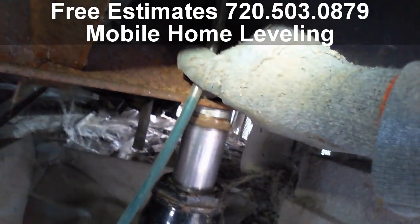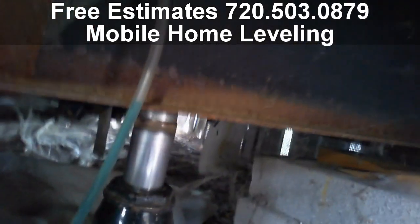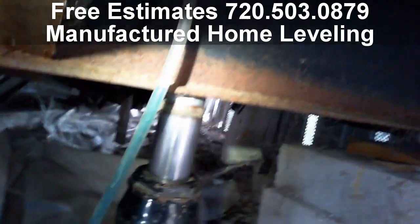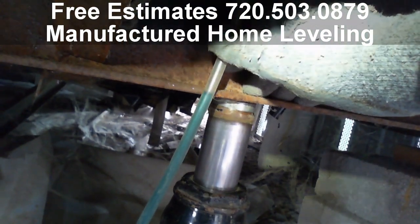Where I set it up at the high point, I had it centered perfectly in the middle of the I-beam. So we know if we're one sixteenth of an inch off on the center, we're an eighth of an inch off total — so the goal is to get it perfect. Looks like we're on the money.